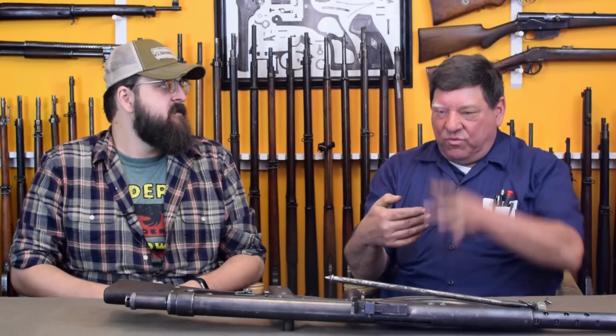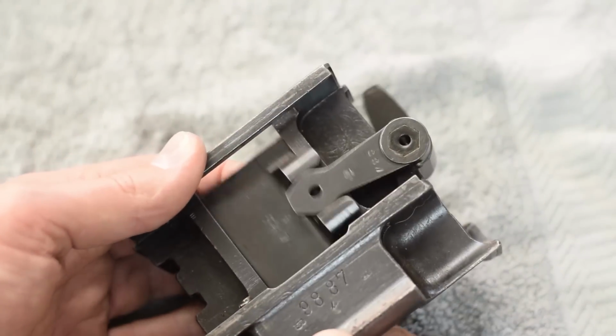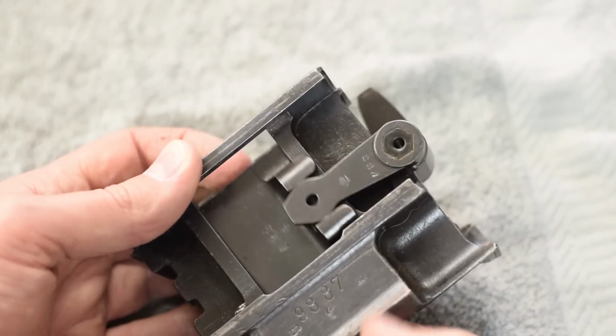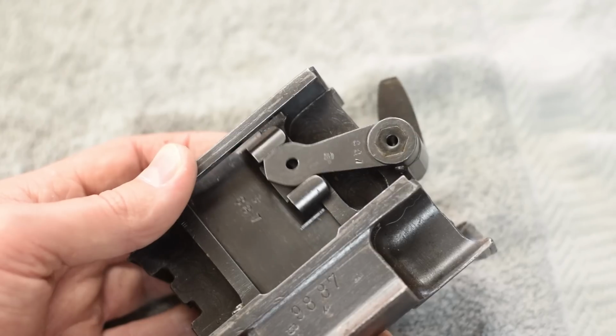It liked its ammo oiled. Well, it's not so much the ammo as the feed block. I've noticed that if you saturate the feed block with lubrication, that gun runs so much better. Again, that may be a wear issue. When we fixed that one feed block, there's 3 things that have to slide up and down relative to each other. So there's a lot of tolerance stacking, and the round will sit there and walk side to side to where it won't even go in the chamber anymore.